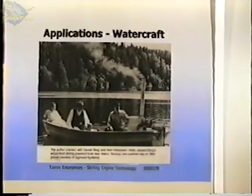My engines, I limit the pressure to 150 PSI because I figure that's what people are comfortable with, you know, the average citizen. My motto is that anyone who can drive an automobile should be able to operate one of these engines. And so I try to keep the pressure down. I pay a penalty for that in weight, in that the engine has to be physically larger to achieve a given power, whereas you could do it with a smaller engine operating at a higher pressure.